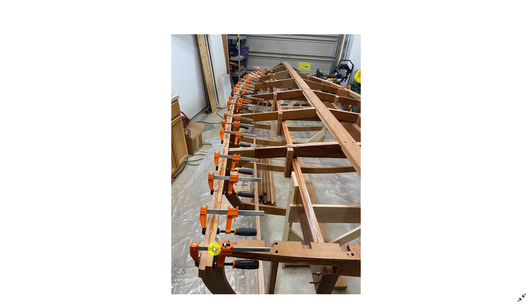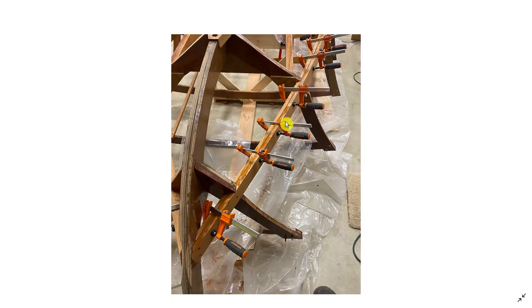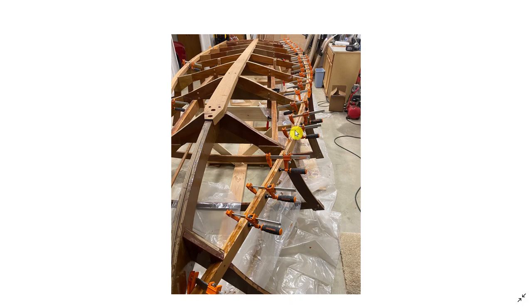After putting epoxy in for the second lamination, there's a screw at each frame, and then all those clamps come into play in between the frames as well, to ensure a good consistent joint without over-clamping. Towards the front you can see all the clamping. The nice thing about the second lamination is you're just clamping to the first one, giving you a nice clamping surface to work with. I did the same on the port side — and that's how I attached the chine logs.